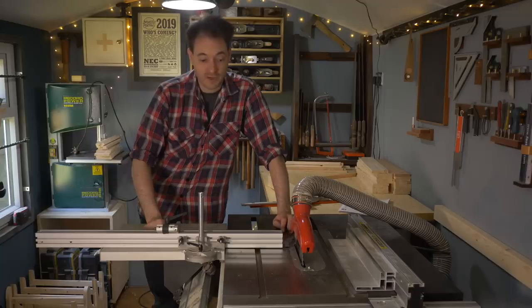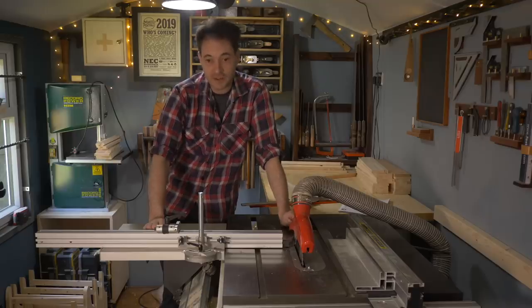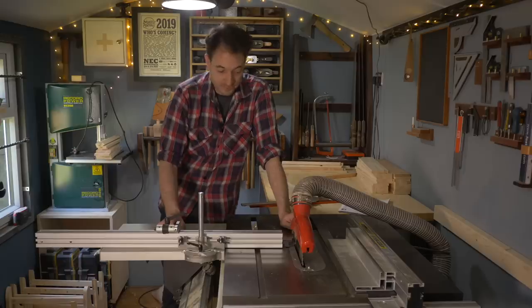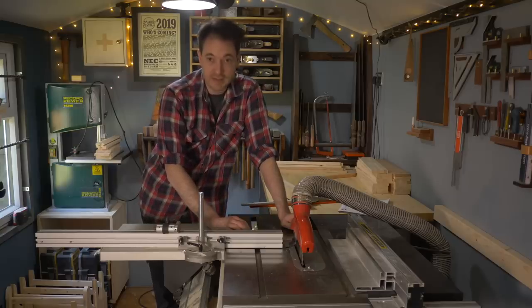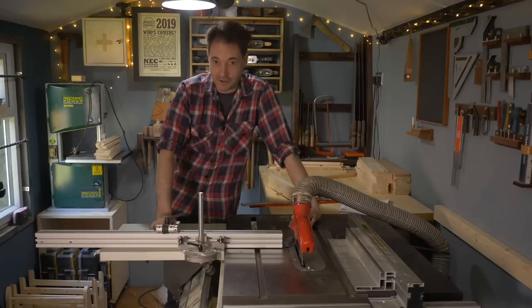I had a few questions about how powerful this saw is. Compared to contractor saws the specs might not look as powerful, but it's not a fair comparison because they have universal motors and this has a nice quiet induction motor - and it's belt driven. This week I was cutting down some 3x2s (about 63mm deep) in one pass, and I also ripped down some oak with no problem at all. At the moment it's a bit handicapped because it has a 48-tooth blade in it - that leaves a beautiful cut but it's not a ripping blade. With a 24-tooth ripping blade, which Axminster do sell, I think it would have no problems. If you mainly want to rip hardwood, you'd want something bigger, and a bandsaw is probably better for that.